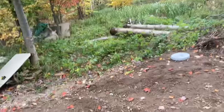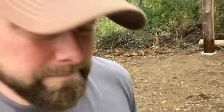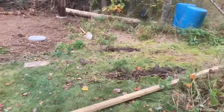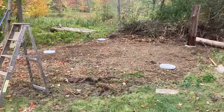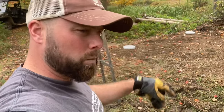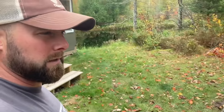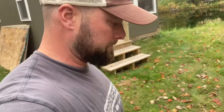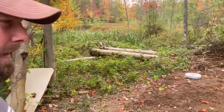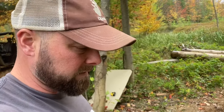roof. I'm building this next to my kind of a wet area by the pond. But I've put a pad of gravel down. And my wife's not going to be happy with me because I tore up the little yard getting this gravel here. I've already squared up these paving blocks. I didn't want to dig these posts in like normal because I would hit water after digging pretty shallow. I'm going to hit water because I'm so close to the pond. And I've already found that out by building this cabin here. Hopefully with these pads, and they're all leveled up, once I build this thing, it'll kind of sink. Once it's tied all together, it'll sink at the same rate.